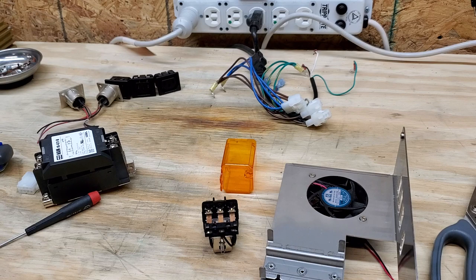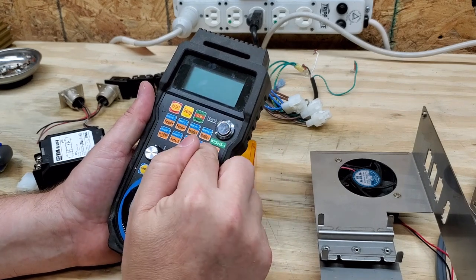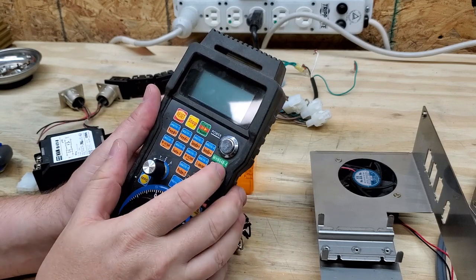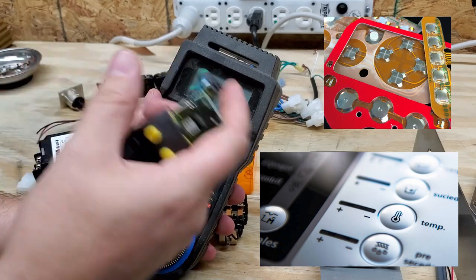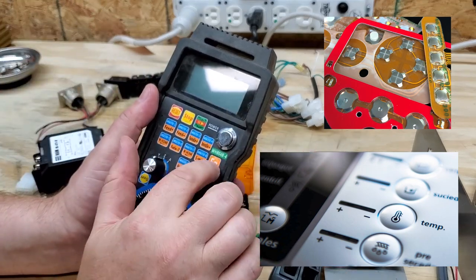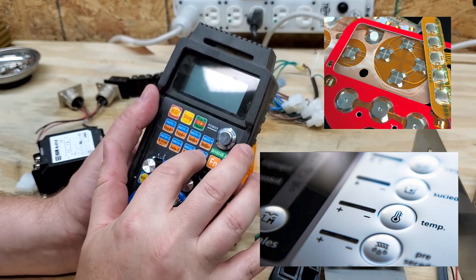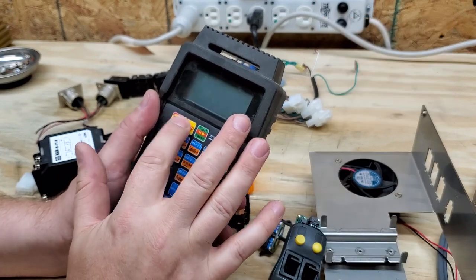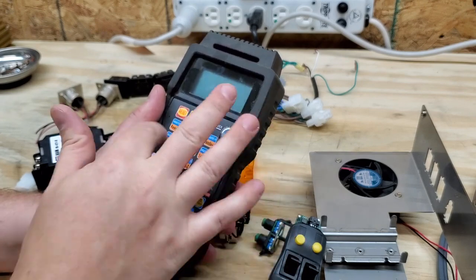There's another type of silicone button that doesn't go clickety clack, and on the back of the silicone button is going to be carbon deposits — those are just silicone carbon trace buttons, and you find those often on calculators and various other things. I'll show you an example from my remote over here for my CNC machine. We see these on all sorts of medical devices — these are called membrane buttons, and they're very similar to the dome buttons. Right underneath the surface you're going to have a metal dome that you press, and that's what gives that tactile clank. So those are called membrane buttons.